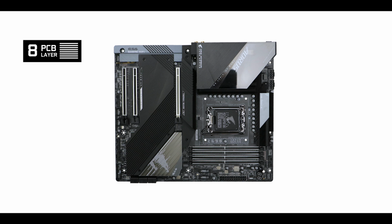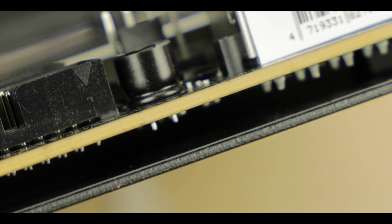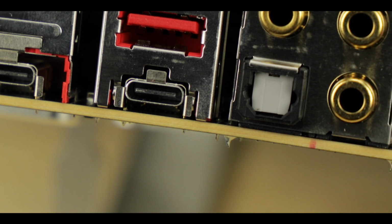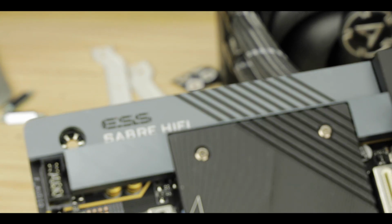We are dealing with an 8-layered ATX PCB, which is a little more than we used to have, but obviously perfect to properly isolate PCIe 4 and PCIe 5 signaling. But no less importantly, it does provide a greater VRM diffusion and a better sound isolation as well. Definitely a big premium feature on this board, especially when you know that adding a couple more layers does cost quite a bit of money to the manufacturers, but it definitely is also the hallmark of a robust and long-lasting